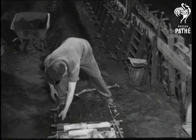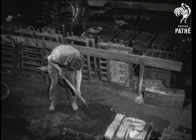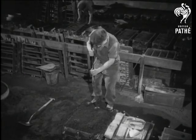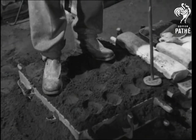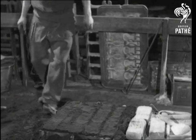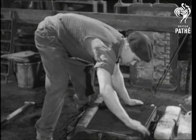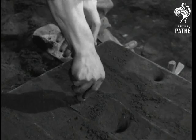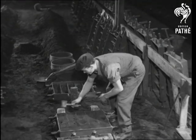Moulders have sensitive, skilful fingers. The box is topped up with more floor sand. The sand, owing to its clay content, will now be firm enough to withstand the weight of the hot metal. A final stamp down all over. The man's boots are made to keep out sand and to protect him from any splashes of molten metal. The box is levelled off. Holes are made in the sand — two for each hotplate — so that later molten iron can be poured in. These holes are carefully smoothed off so that no loose sand remains.